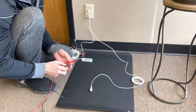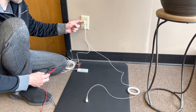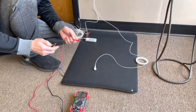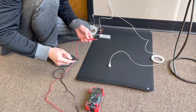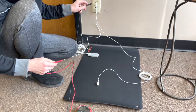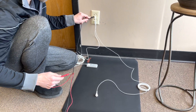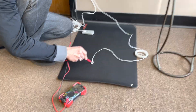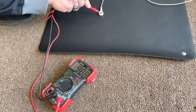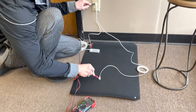The Hygge grounding cord, as you can see, is plugged into the ground of your outlet. The Hygge grounding cord has a safety resistance of about 98 ohms. I will demonstrate that by grounding the black prong and touching the grounding cord with the red — and there you see the 98.8 ohms safety resistance.